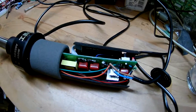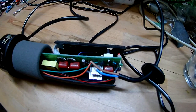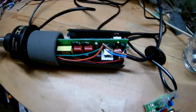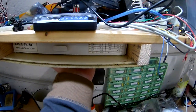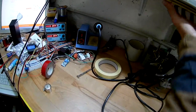I've got to get a 1 ohm, 1 watt resistor, because this is clearly half watt or rated at 0.25 watts. All these small ones are supposed to be rated at 0.25 watts. I don't know - I have to fix this at some point.